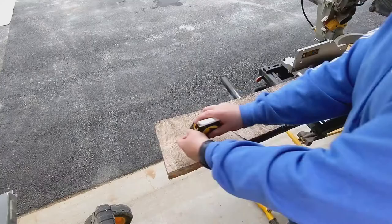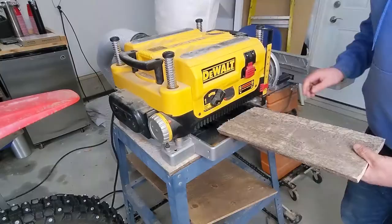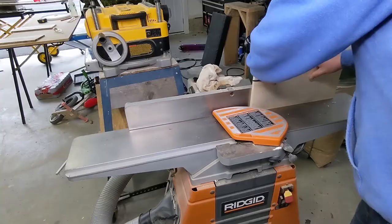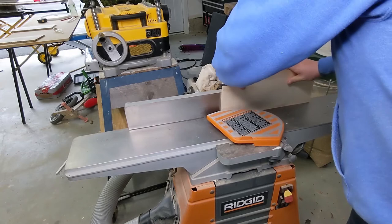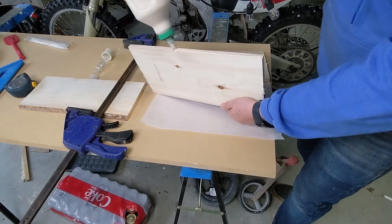Super easy! To build the base you need a board. First you're going to measure it, then cut it, then cut another piece, then plane the heck out of it. It takes a few runs of the board if you're using a warped plank. Then after that, plane the edges so you can glue them together — immediately realizing it's much easier to use a table saw. Then glue them together and clamp that.